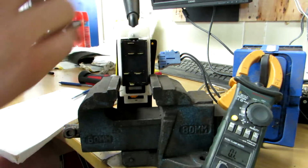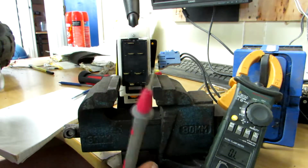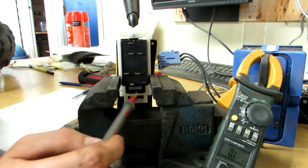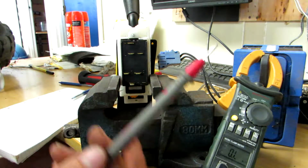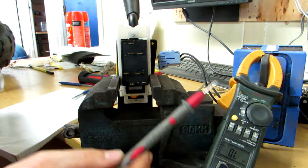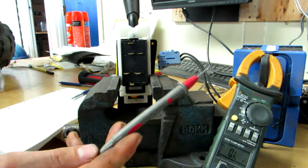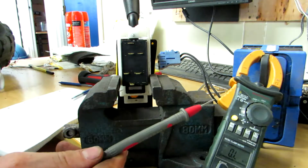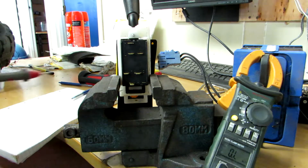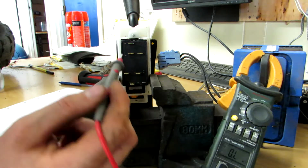I am also going to test something. An idea I just had before is that reverse gear just reverses the polarity and it goes probably in like first gear. First and second gear going forward may be a parallel connection and a series connection. So series would be first speed, parallel would be second speed, so you get all your power going to two different motors. So I can't just test the input and the output, I'm going to need to check all the others between everything else.